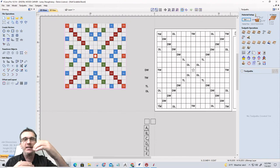But it's lost its steps in one axis or another, and now it's carving, creating kind of a shadow effect, if you will, and things like that. And that's a loss of steps. So in your case, it was a coupler problem, right? You were losing steps in that axis. Very good.